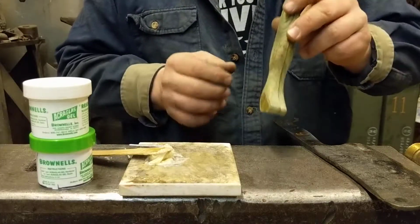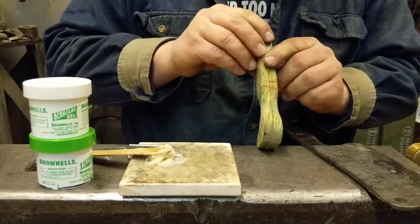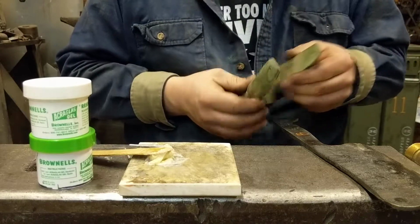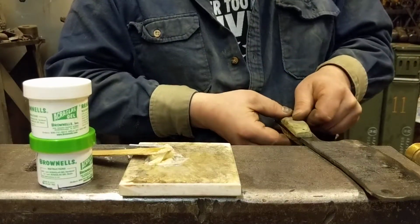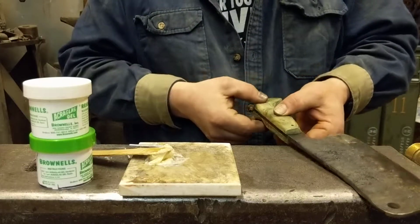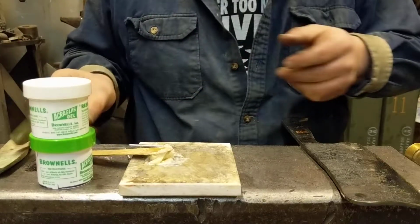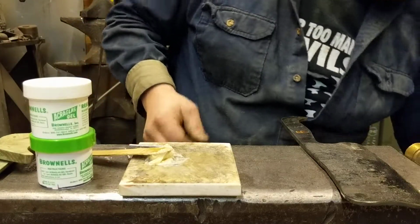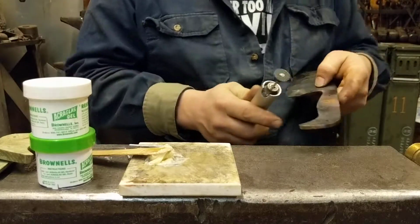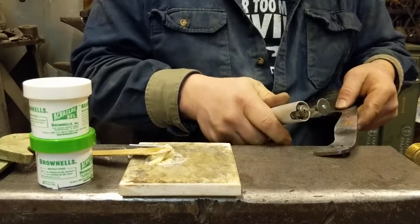I don't have to try to sand that out so tight. So you can see I've kind of got them shaped where I want them. They're rough sanded, rough shaped out. Once I get everything done, I'll have the scales installed with glue, and then I'll start sanding them out, completing them by hand. So the next thing I do is I take my Dremel and I'll add some glue grooves, or grooves for the epoxy to grab to.